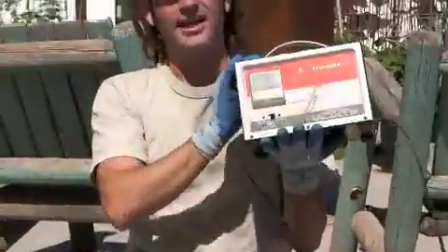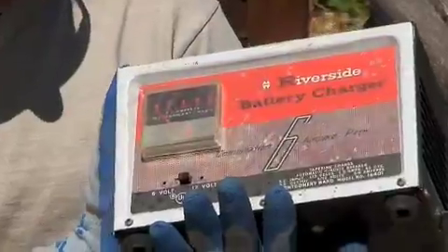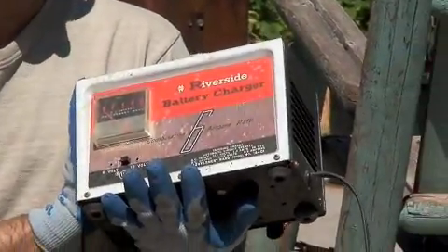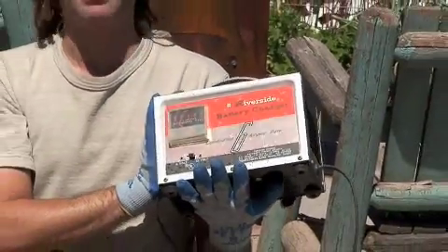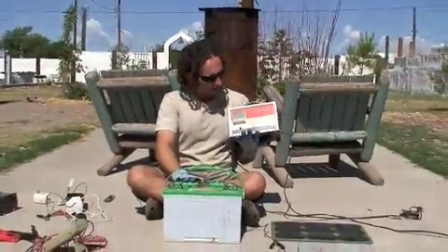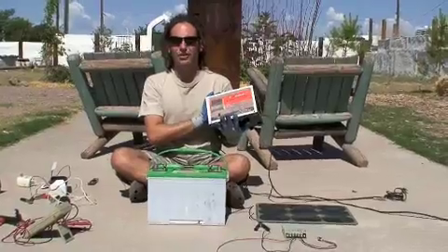There is a third type of charger that I occasionally use: automotive trickle chargers. I like these because they do have some smarts — they back off as the battery gets charged, eventually settling into a small trickle charge rather than pushing 8 amps into the battery continuously. These are good for flooded deep cycle batteries, but I don't like them as much for motorcycle and gel batteries, as they tend to charge a little too quickly and can overcharge.